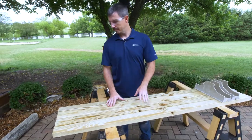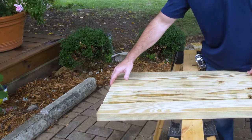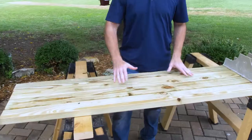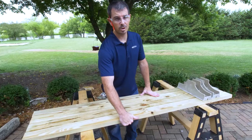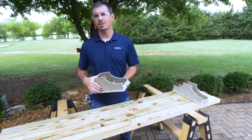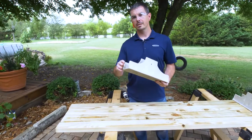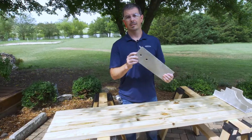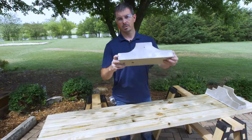We're going to take four of the full-length boards and lay them out. Two things to consider: one, you want to make sure the end is square, and the second thing is we're going to build from this point forward upside down, so you want to make sure the good side is towards the ground. Next, we'll take the pivot brackets and place them five inches from each end. One thing to consider is there's an open end and a closed end. On the open end, it's marked front — make sure that's facing you.